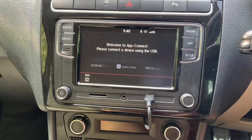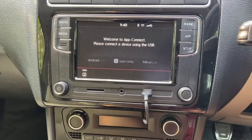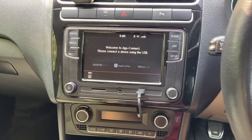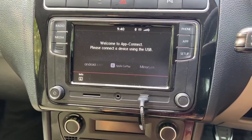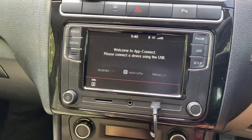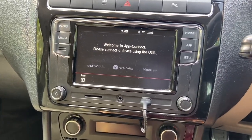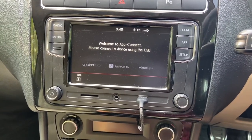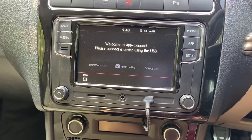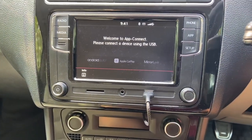In this video I'm going to show you how to hide this USB cable which is connected to the front of the unit. You can see that it's jutting out like a sore thumb in an otherwise fairly clean console. What you're going to do is solder a female USB connector to the same port. You'll have to open the unit, expose the circuit board, and solder the four or five leads to the existing USB port. Be warned that you can't use both ports together - you can only use one, so this renders the front one useless if you've already connected the one through the rear.